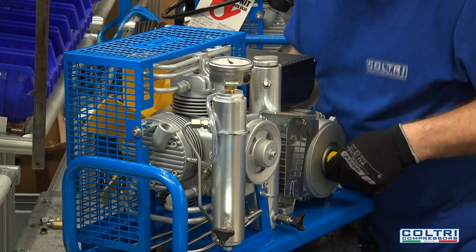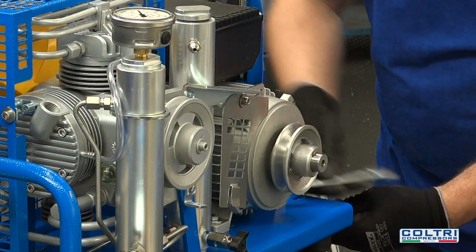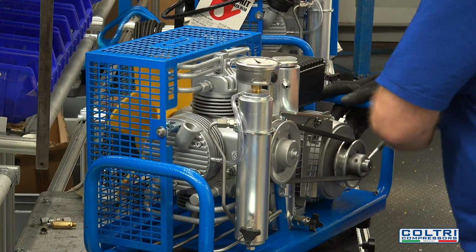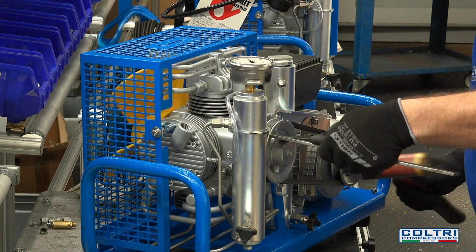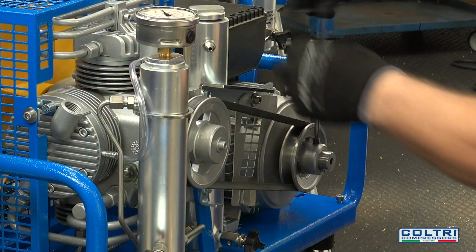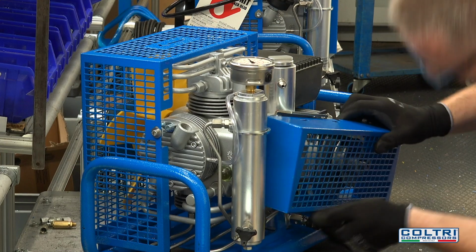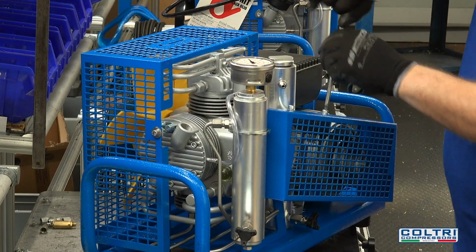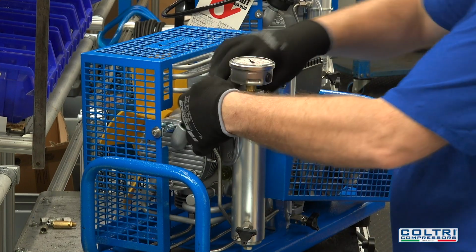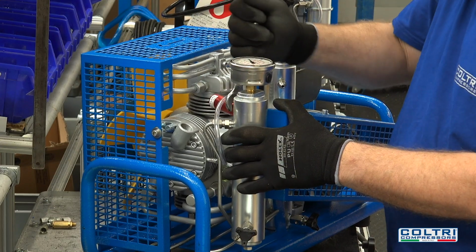An electric motor or internal combustion engine is mounted on the frame. The worker then inserts the crankshaft and transmission belt, checking for correct alignment. The pulley is fitted and shielded with a mesh, which is secured to the frame. The safety valve is then installed on the condensate separator and an intake filter, complete with filtration cartridge, is fitted.